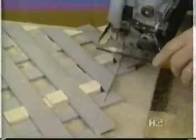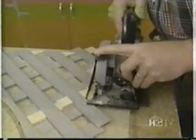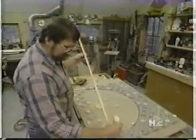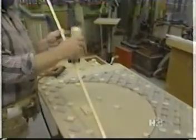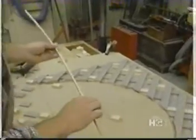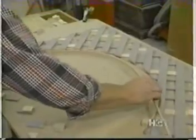Well, just as with the railings, I'm trimming the edges with my small circular saw. To finish off the inside of the arch, I've ripped a piece of cedar that's a little over a half inch wide, and it's 3/16 of an inch thick. I've rolled on some waterproof glue. I'm going to try to bend it around the inside of the arch and hope that it doesn't break.